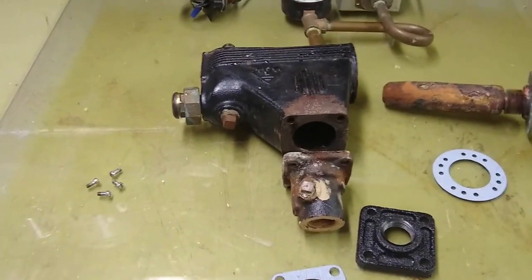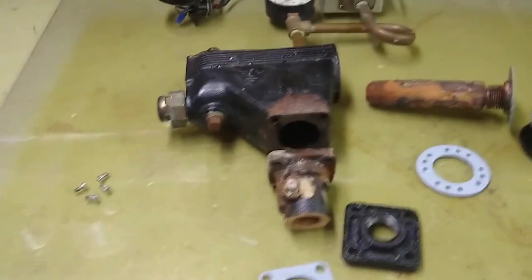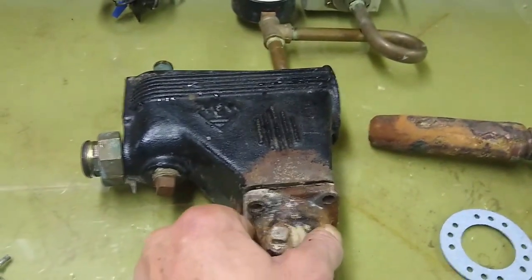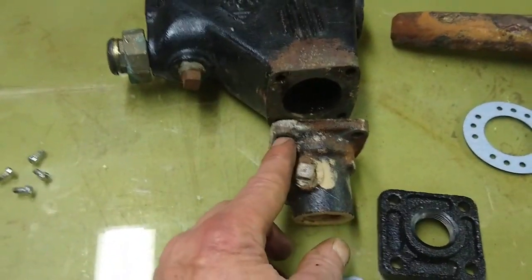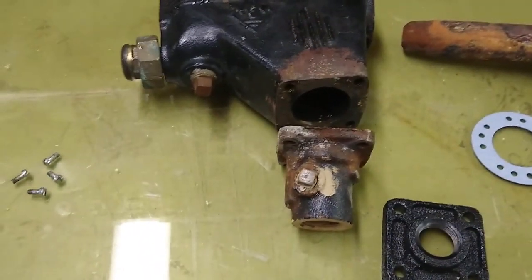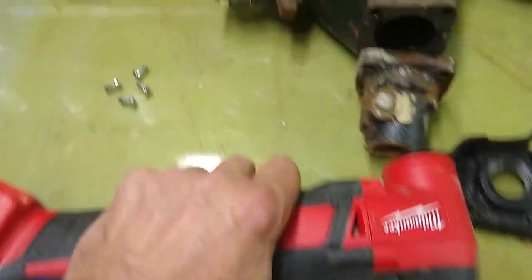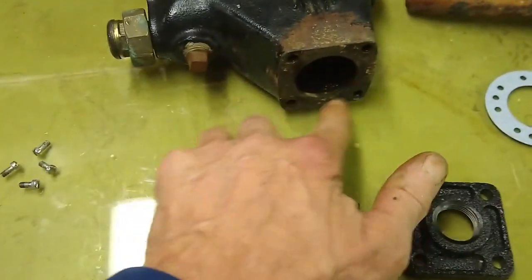The float was not functioning, so it wasn't turning off the low-water cutoff switch. The first thing I did was I removed this flange right here at the bottom of the valve so I could look up in there. In order to remove that, it had slotted head screws on there. I could not get a screwdriver to turn the screws — they were just bending over. They were shot. I had to cut those screws off using a multi-tool with a carbide tip blade. I went in there and cut the heads of the screws off.